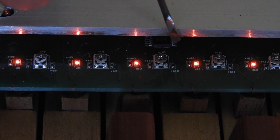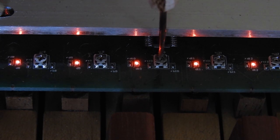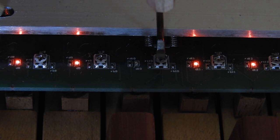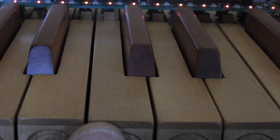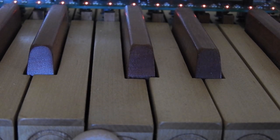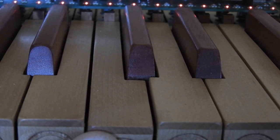As I mentioned before, above every sensor is located a small trimmer. With a small screwdriver, also sold together with the set, we can regulate the depth of the firing point. Here is an example of how it can be set from very deep to extremely shallow. Please note the position of the key relative to when the LED turns ON or OFF.